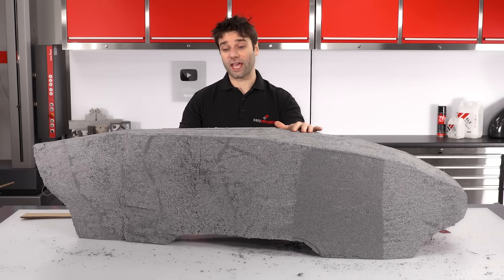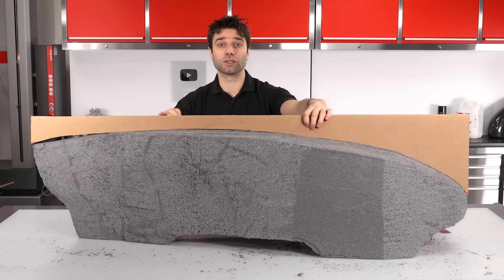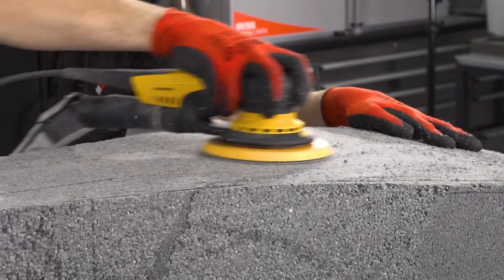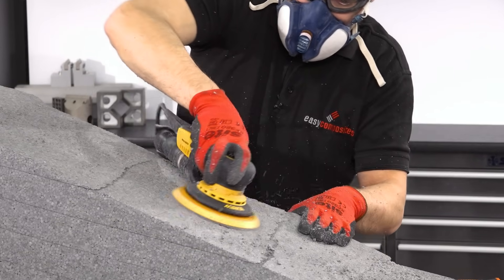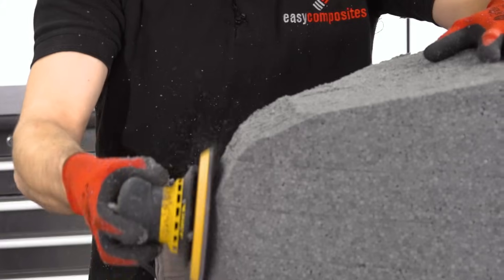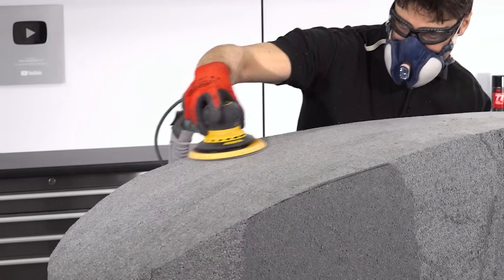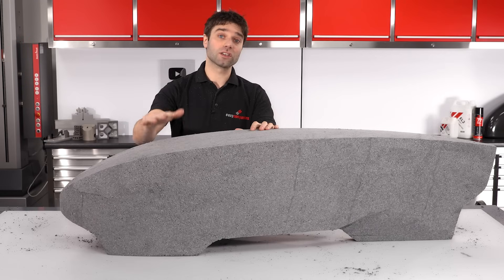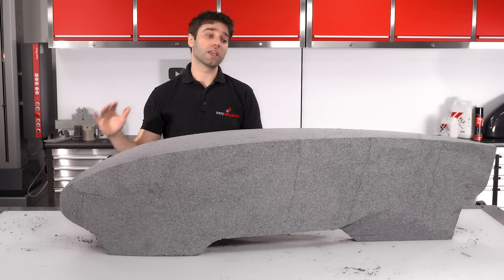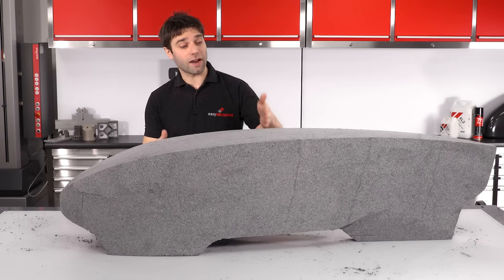So I've now got the foam roughly shaped. To get these two profiles really accurate, I'm going to use the other side of the cardboard template and sand in until I've got a really close fit, and I'm going to do this before we start bringing in the compound curves. The refinement of the shape can be done by hand with sandpaper on a block or, like I'm doing here, using an orbital sander with a fairly coarse 120 grit pad. Now that we've got these main profiles cut and sanded in, you can really see that the shape is starting to take form. From this point forward I'm going to be working freehand and just shaping the compound curves in by eye. But if you did need a higher degree of accuracy, you could make yourself some reference profiles and work to those.